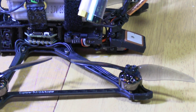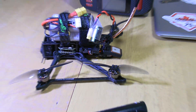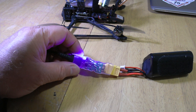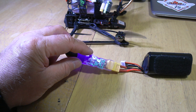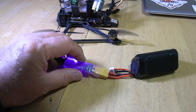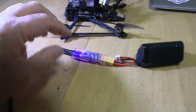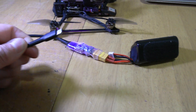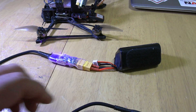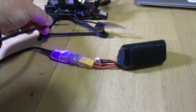The video transmitter gets really really hot. So a quick tip: get one of these — it's just a car USB charger adapter. I took one apart, stuck an XT60 on the end of it, and then added a short USB-C cable on the other end.